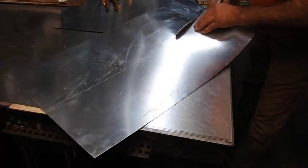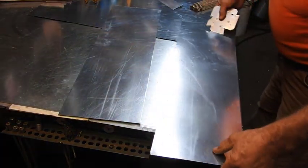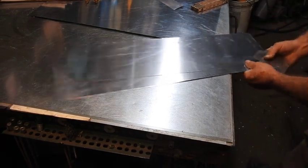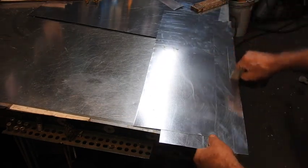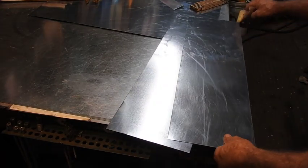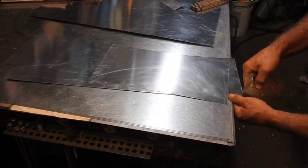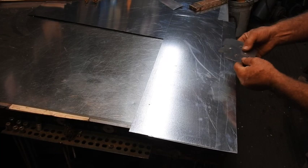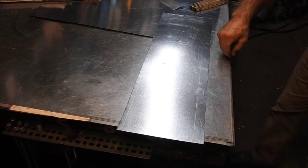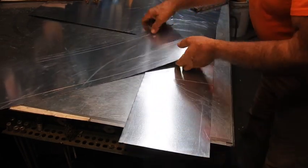Now we're going to cut it in half. Here are our two halves. Take our handy-dandy scribe — we know our Pittsburgh is going to be on this end here, so we can mark our Pittsburgh. We can mark our half-inch double hem, which is going to be a one-inch mark and a half-inch mark. Do the same thing on the other piece: half-inch, one-inch. Now we know we have our quarters. Then up on the top we have the one inch for the S and drive. A lot of times with a little one like this I'll just rip it right off the edge of the workbench — set it right on there and just rip it right off. Does a real good, fast job.